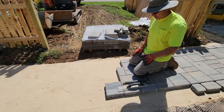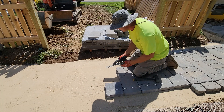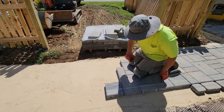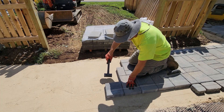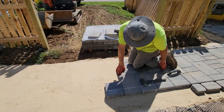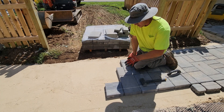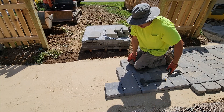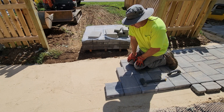When you get going laying your pavers, make sure you keep your dead blow hammer and your trowel nearby. The trowel is so that if you see any imperfections in the sand ahead of you, you simply smooth them out. The dead blow is for when one of your seams isn't lining up perfectly straight — you give the pavers a little tap to get them into place. Watch your seams: on this narrow 3-foot walkway with a random pattern, it's hard to avoid seams, but make sure you don't have a seam running straight down the whole thing. I try to keep the seams to 3 feet or less.